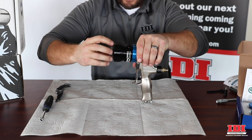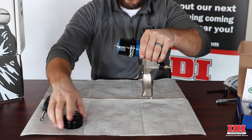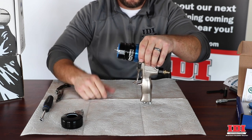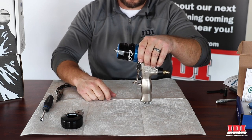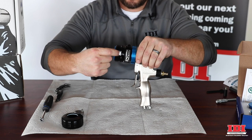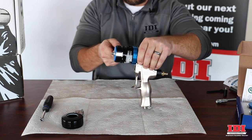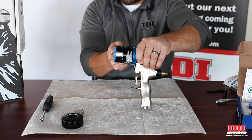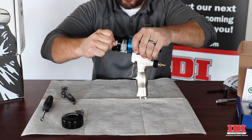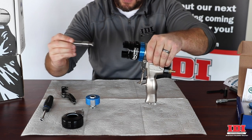When you're taking it apart, we take off our air cap and our retaining ring. I can take this apart nice and easy because it's brand new. But when it's full of foam and you can't take it apart, here are a couple of things Graco engineered into this gun. You're going to see right here there's a slot — a flathead screwdriver slot. You can do it from the back side and pry that cartridge off. You can see it coming off there. So when it's full of foam and chemical, you can pry that off and then access your mix chamber — still an easy, smooth process.